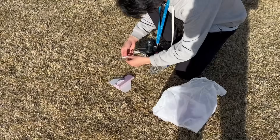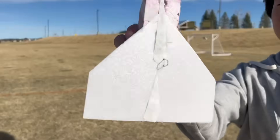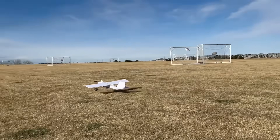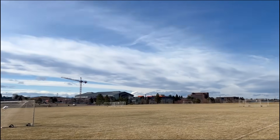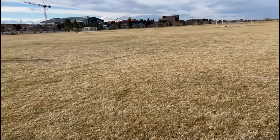I went ahead and added some nuts to the bottom of the plane to hopefully move the CG further down to get it to fly upright. After releasing it, it actually started to fly — not that great, it was still just getting blown away sideways, but still pretty good for such a small glider. It was aerodynamically stable, but the wind was just pushing it across so it looked like it was flying sideways.